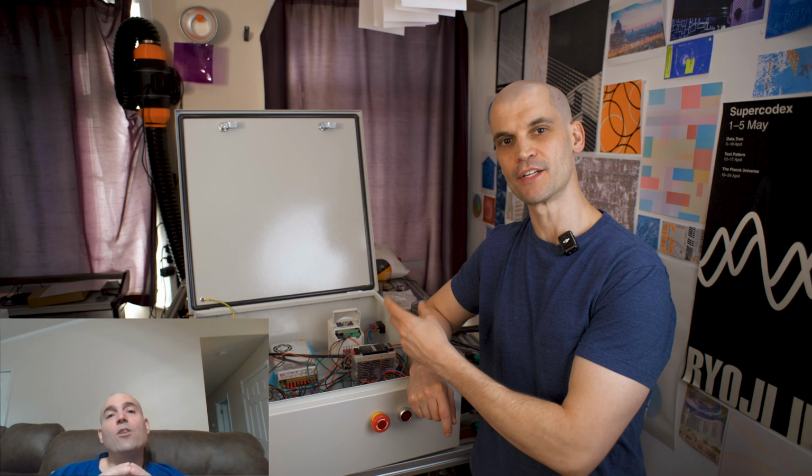Now, Paul, we're not just trying to redirect the energy, we want to dissipate that energy. Therefore, terminating the shield drain, if your cable comes equipped with it, which I prefer, or the shield itself in his case, where he puts a lead on it, terminates it with solder and flux, and then dissipates it to the ground bus, is best practice, because that ground bus takes the energy and dissipates it to mother ground.